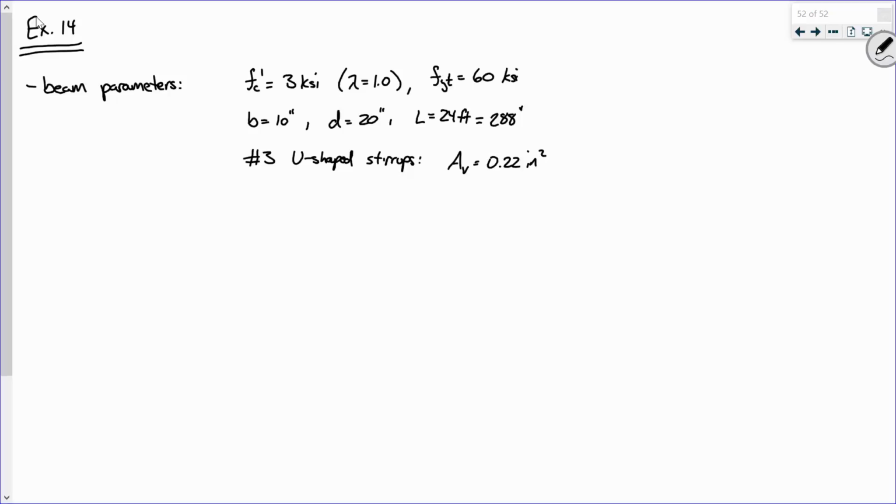Yes, yeah, and if number 3s aren't used, number 4s for beam applications. Now let me say 2 things. Number 1, if you're dealing with really, really high shears like in a bridge, you might actually need some serious beams for shear. Right around the pier location, you can have very high shears and very high moments, and you can have rebar going all over the place.